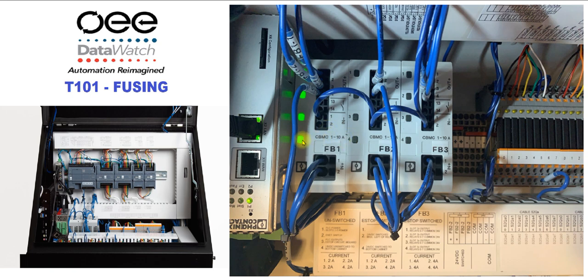To program a channel for the current that you desire, make sure the light is green first, then press and hold it down for greater than 2 seconds. It will begin to flash yellow. There's 1 flash per programmed amp. So the default is 4 flashes you'll see, and that's 4 amps.